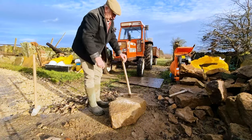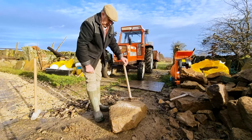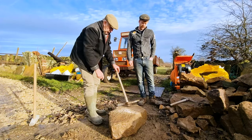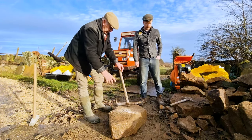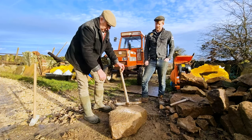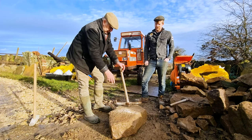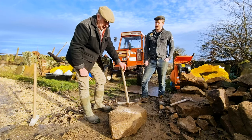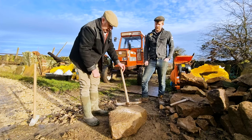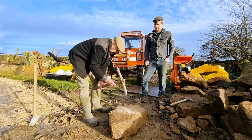Very hard sandstone, this — some of the hardest I've ever had to cut into, so we'll see how it goes on. I'll cut another one here now. It all depends on the depth of the stone as to how near you put each wedge hole to the other. A piece of stone like this — there'd be plenty — so I'll cut another one here.